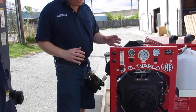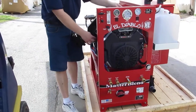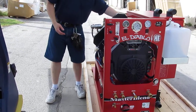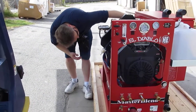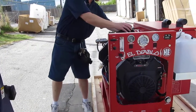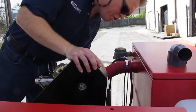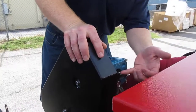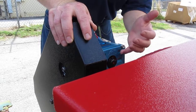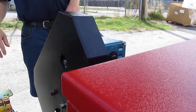Servicing this machine is real easy to do. You can change the oil here. It has two spark plugs that are easy to get to on the sides. There's also an oil drain on the water pump that holds a little bit of oil. There's a little sight window on the back side that lets you know the oil level — ideally you want to see a little bit of air space on top so that your oil is about 50% across that window. Right now the machine is not on level ground so it's not reading perfectly.